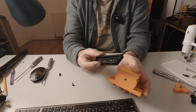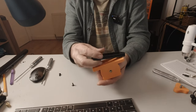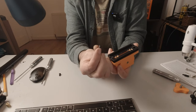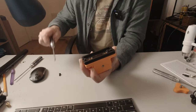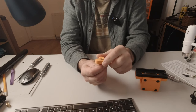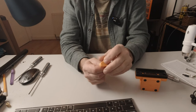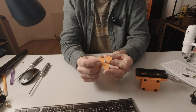Take a 100mm long camera Swiss plate — there are two holes in the flat face which should line up with two of the holes in the Swiss plate. Take two 10mm long low profile bolts and place one into each of these holes in the plastic. Then find part 45, the turning knob, and take a 40mm long M6 hex bolt, pressing it in. You can add a little super glue behind the head to keep it in place — it should protrude from one side of the knob.